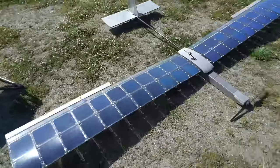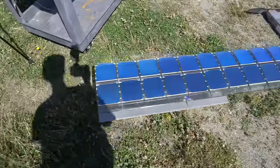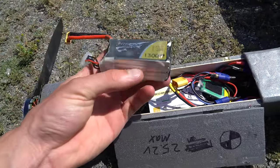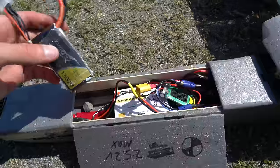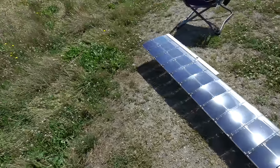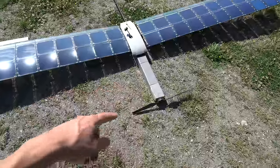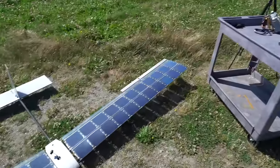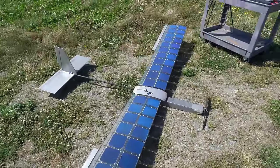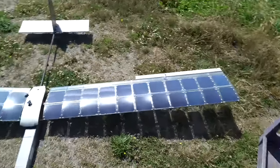That was great — got reunited with the old solar plane. I've gotten better results in the past but that wasn't bad — still a pretty long flight for a tiny battery. Pulling out the 1300 milliamp hour battery — it's kind of a crappy old battery, so that's pretty good. The solar cells were definitely doing something, probably delivering roughly 3 amps throughout that flight. It would be great to get another current sensor on here to measure both the motor draw and solar cell output. When I get ArduPilot set up on my next plane, I'll do dual current sensors. Thanks for watching — subscribe for the next solar plane episode. All past episodes are in the solar plane playlist. Adios!